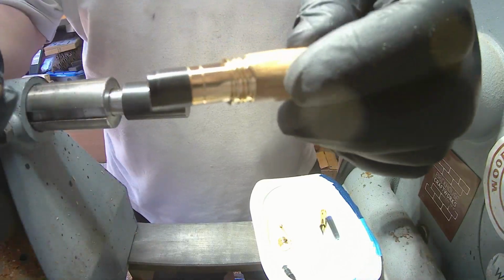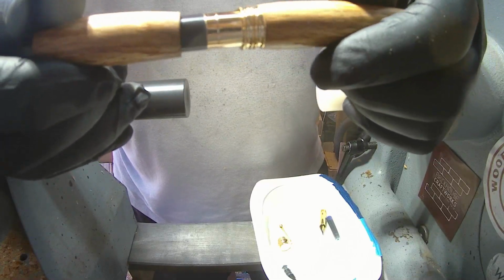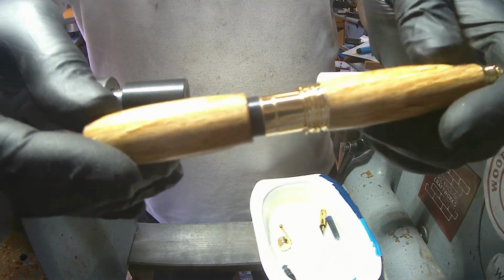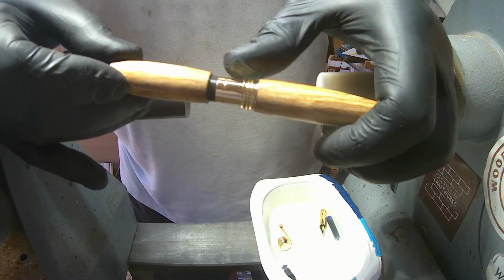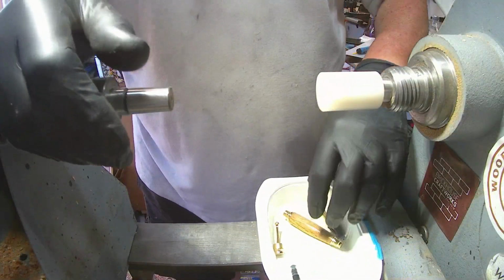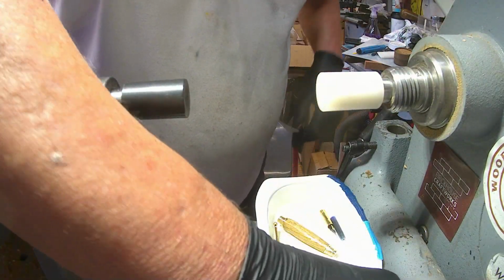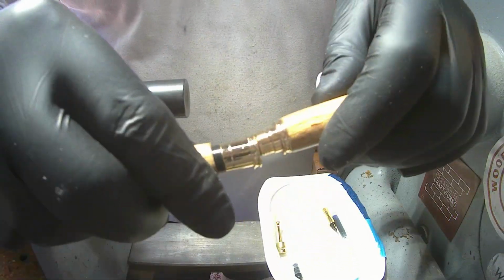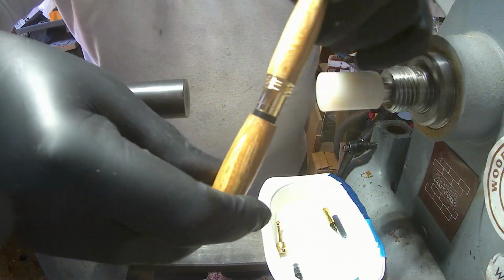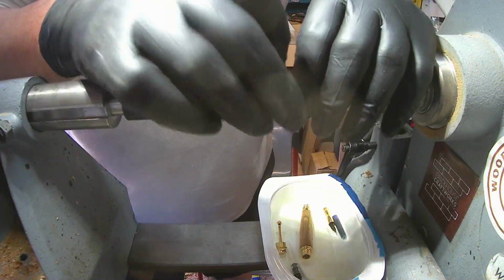So that's the end for the clip. So now I can line that grain up like that, so that seam is running all the way through. Unscrew it, drop it on the floor, just better check. Yep, as you can see, the grain alignment's running straight down there. And now we can push this home.